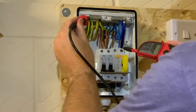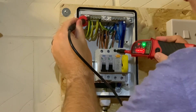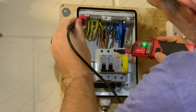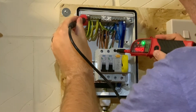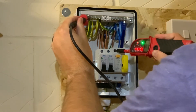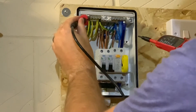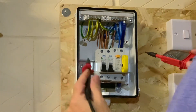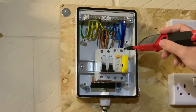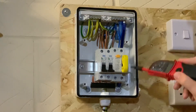Back onto the CPC onto the line, and you should be able to make out this has gone up to 248-249 volts, with the LEDs lit up to 230. Off the line conductor, off the CPC — we've now proved that the incoming side of this RCD is indeed live. We isolated the outgoing side earlier.